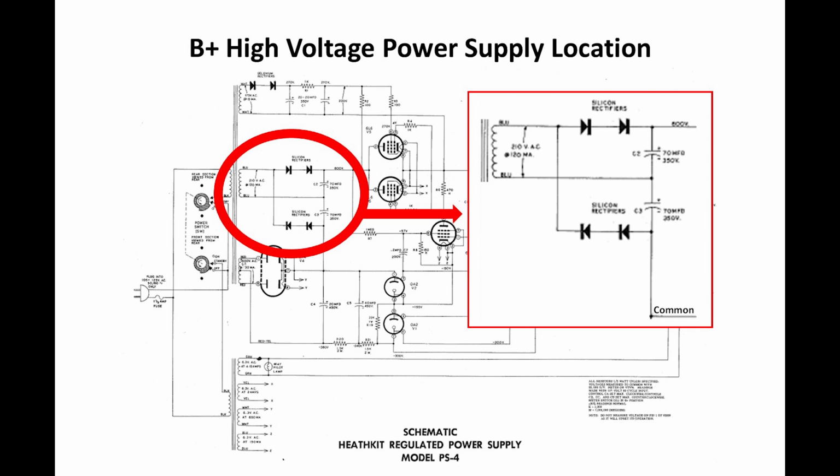It's a full wave voltage doubler. I think it's a Delon type of voltage doubler. I believe that's what it's called. And what it does is alternately it'll charge up 2 caps. We see we got 2 caps in series here, and for one half of the cycle we're charging one of the caps to 300 volts. For the other half of the cycle we're charging the other cap up to 300 volts, and because the 2 caps are in series we wind up with 600 volts on the top of both of them. It's a pretty simple circuit.